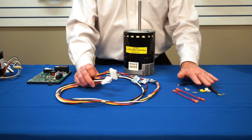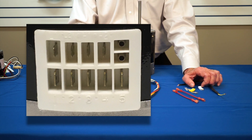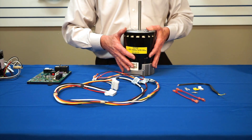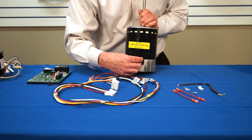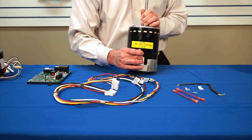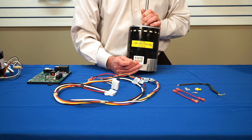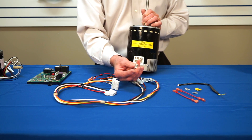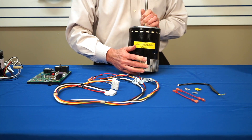We select the voltage of the motor by using a couple of pins. We have a choice for either 115 volts or 230 volts. The motor as it comes in is set for 230. The yellow plug would go into the motor if you want 230 — there are no conductors in that plug; it's filling space and protecting the ports. We're going to connect this particular motor for 115 volts, so I take the 115-volt white plug, which has conductors.